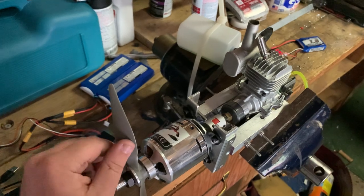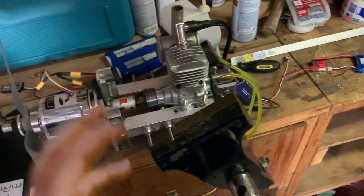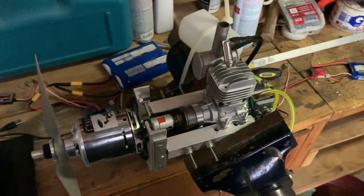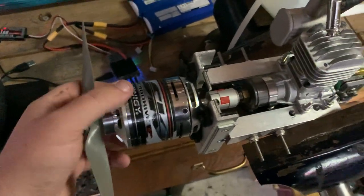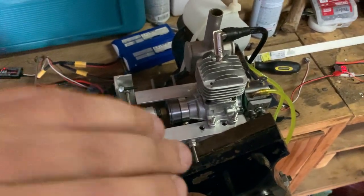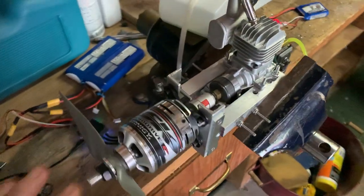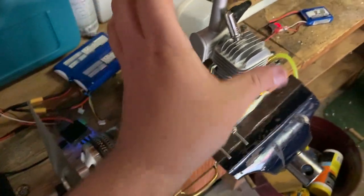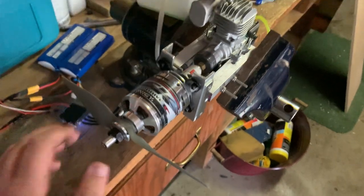This fan right here is just to provide cooling. It spins fast enough to blow air over this. This is an air-cooled engine, but obviously it's an aircraft engine made to have a propeller here, so having a propeller here is good enough. Oddly enough, this motor seems to have enough rotational inertia to act almost like a flywheel — to carry the momentum for the next compression stroke. The propeller also acts as a tiny bit of a load that isn't going towards power generation, but you do need to cool this motor in some way. You could add a separate electric fan, but this seems to be a good simple mechanical solution for right now.